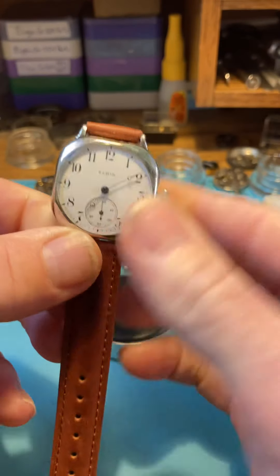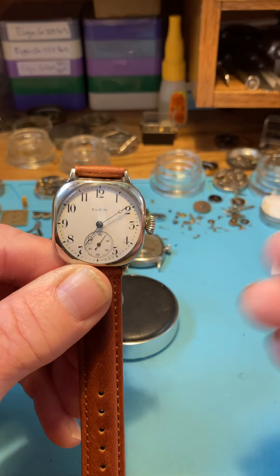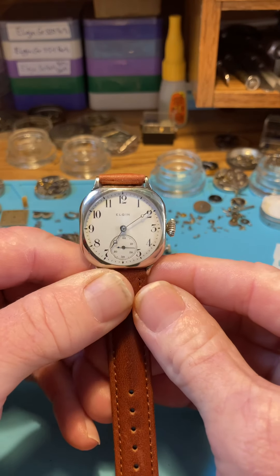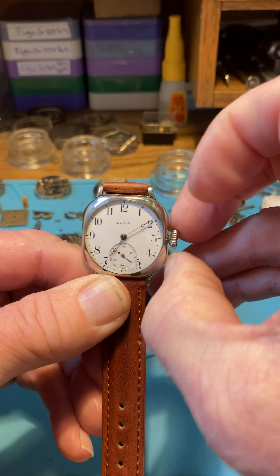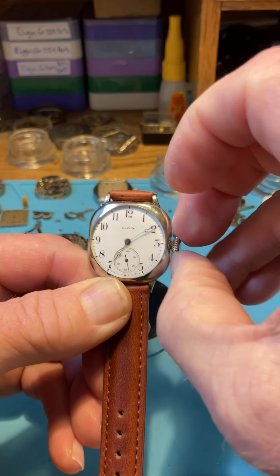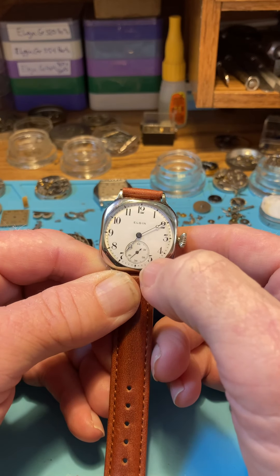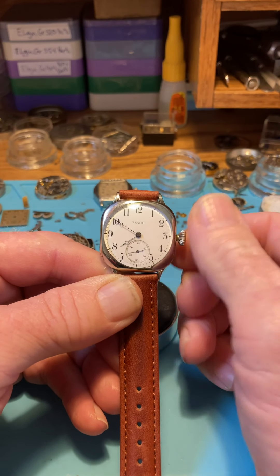Now to set the hands, instead of a pullout like this — just grabbing it and pulling — we want to be a little more gentle with it. That way the mechanism that's in here, which is different than Swiss or anything else, will last a long, long time. So we're going to do a pinch behind the crown instead of a pullout. Pinch behind the crown, push it back in, a little pinch — you'll hear a little click. Now when you set the hands, we want to go in the forward or clockwise direction. Don't whip them around. We don't want to go backwards — always go forward. Take your time.